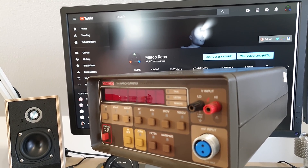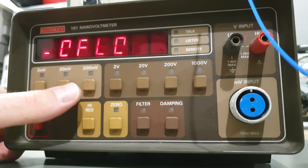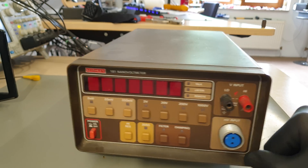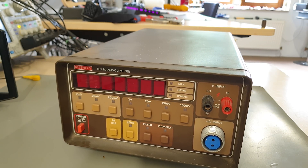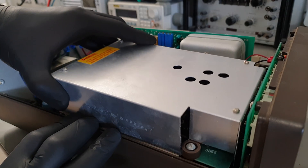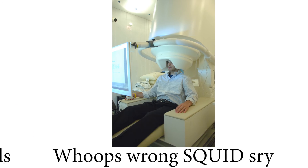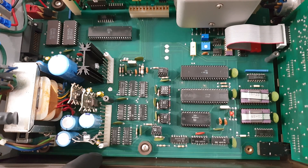Whether or not we get to see a more modern version depends on how quickly we reach 100k subscribers - it will be close, because this thing has been listed as defective correctly for once. Beautiful: a stuck power switch, a constant overflow display, missing segments, and a missing millivolt input cable. This is a model 181 nanovoltmeter built in 1980 - only five years younger than the previous microvoltmeter but about three orders of magnitude more sensitive. Had Keithley released more and more sensitive voltmeters every five years they'd already have to be further than yoctovolt. The most sensitive voltmeters today can measure only picovolts, and even in this relatively modest device we'll get to see some of the physical non-negotiables that hinder further progress.